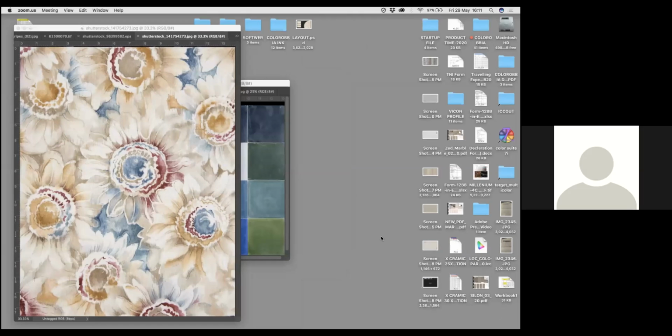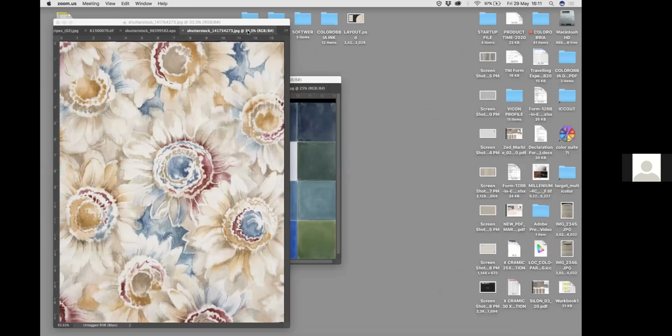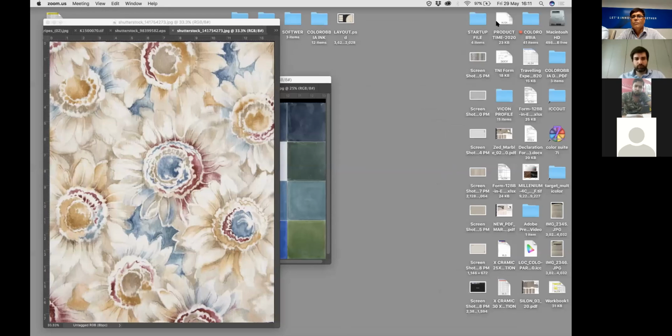Then periodically what we suggest, especially if you're not using the machine, is to purge. So we have a procedure that is called rain, that is needed for activating nozzles because the ink will dry, but this is not necessary for the printer, but because some inks after a long time will dry. So it's necessary to, let's say, simulate print or drop. But for the standard condition, the only thing that is needed is suction. So it's not wasting ink. Then it can vary from ink to ink and from the line speed. So it can be 4 hours, 3 hours, but this is created automatically by the printer. You don't have to stop the line. You can connect the interface with the printer so that the printer will create a gap just for the time necessary to execute the cleaning procedure.